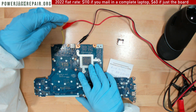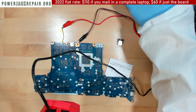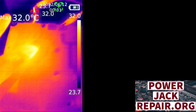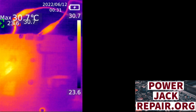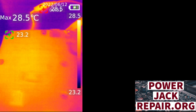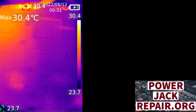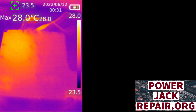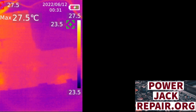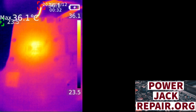Let's wipe the area clean and check if any capacitors light up on this side. Switch to infrared — you can see right away it doesn't even want to cool down in this area. Let's reduce the amperage down to two amps because that's probably less damaging. Let's do a global picture — three, two, one, power up.